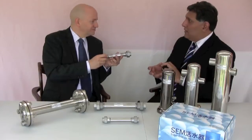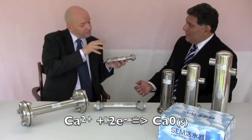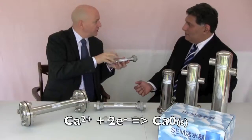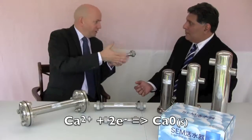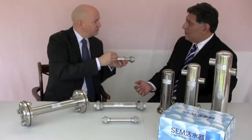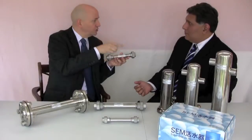Gradually it'll start taking the scale that is sticky. It's all chemistry and physics in there. You had the calcium in the water going through the vortex, and then you get negative ions bonding with the calcium to change it from a positively charged particle into a negatively charged particle. Effectively, that turns it from a sticky molecule into a non-sticky molecule so that it no longer sticks to the pipes. This creates those negatively charged ions which travel through into the pipe and start to negatively charge the existing limescale, slowly but surely wearing it away.